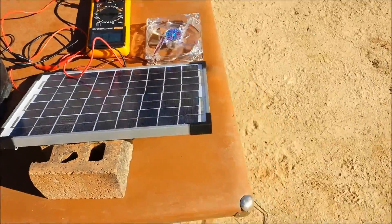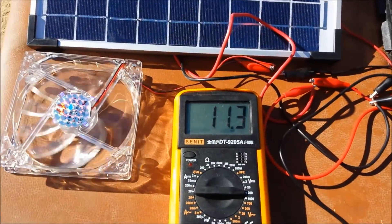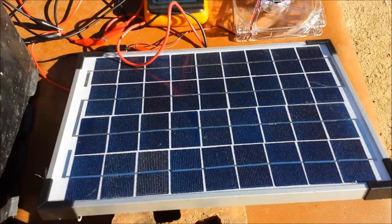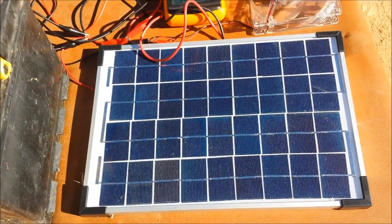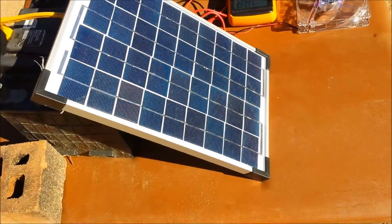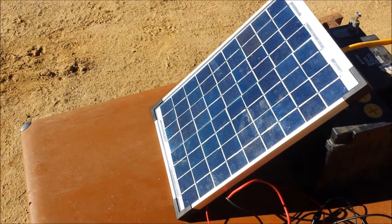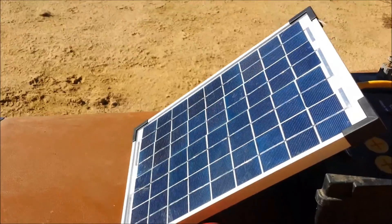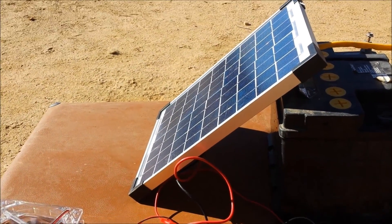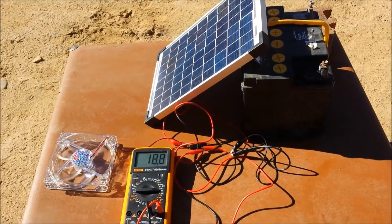In this particular case I'm getting less than 11.5 volts, but if I was to have those panels aligned more in line with the sun — now in my case I'm in the southern hemisphere, so I'll point my panels to the north toward the equator, have it up at about 40 degrees. You want it within 10 degrees of your latitude.